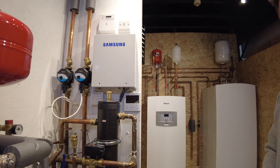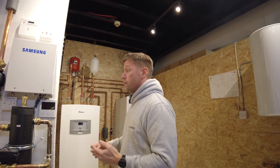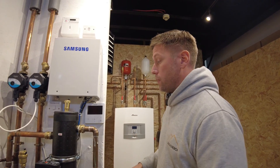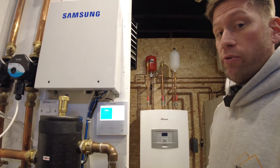We could also face a situation where there's a power cut due to inclement weather, or you could get a different fault with the unit. If that happens, the default for the controller is that the heating and hot water will be turned off. Once we've cleared the fault by pressing OK, we then need to re-enable the heating and hot water programs.